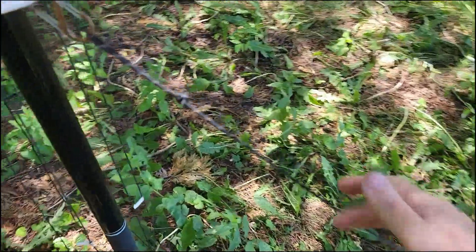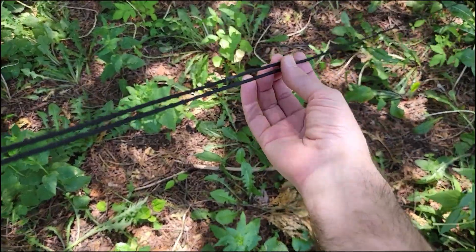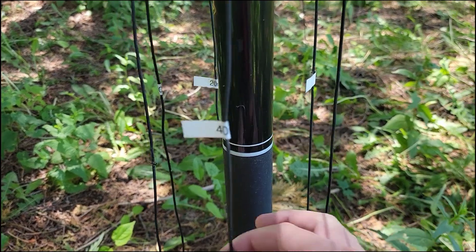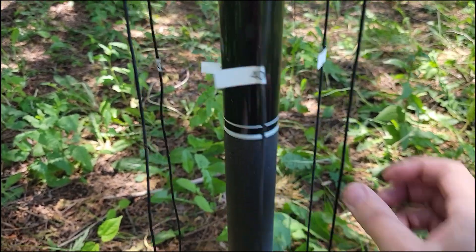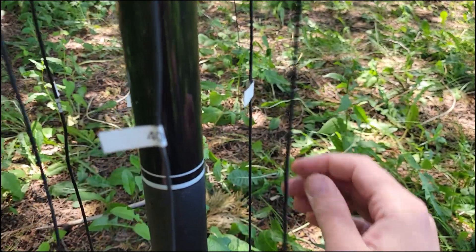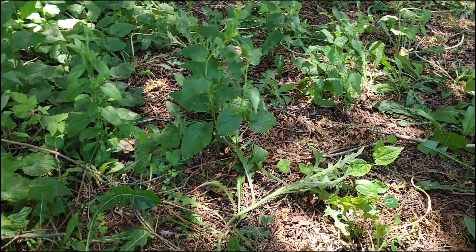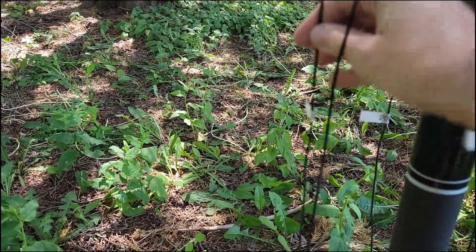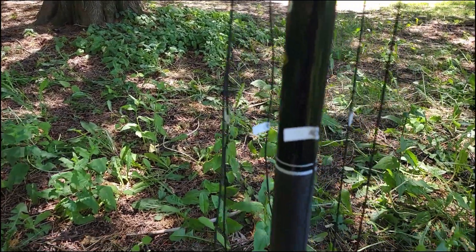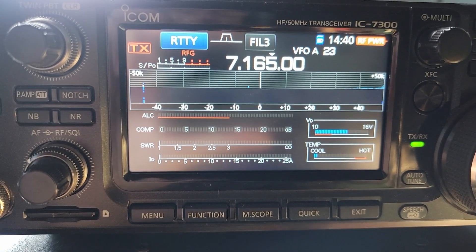We're all set again. I've reattached the guy ropes — guy wires, guy lines, whatever you want to call them — and I've got two half-hitch knots here, so I just tighten those down. The 40-meter element used to deflect a foot and now only deflects a couple of inches — that's good. 17 still has good tension on it. 10 has really good tension. 12 is doing okay. 30 is okay. 20 just ties off to one of the spreader plates and doesn't actually have any shock cord on it. I'll plug the flying lead back in and we're good to go — the antenna is all back up and running.